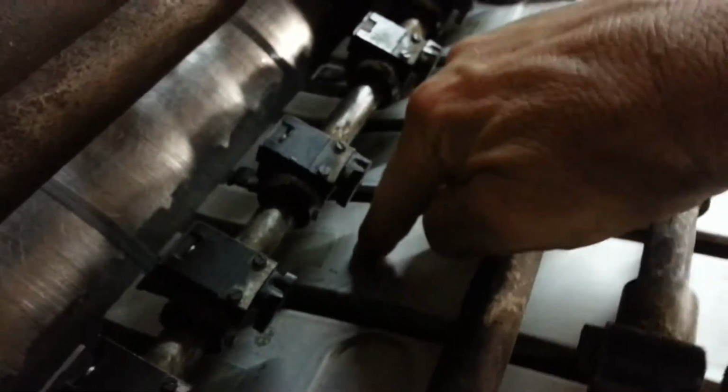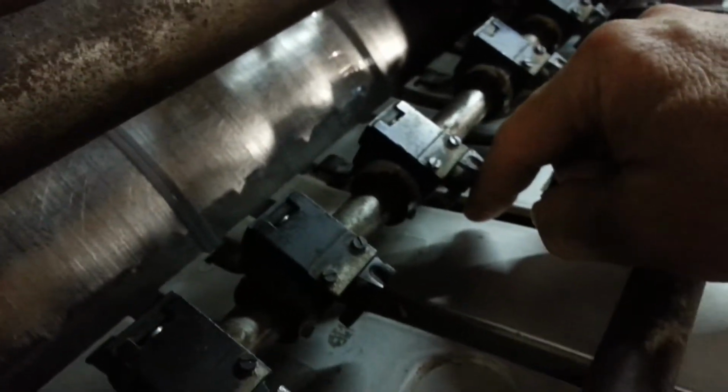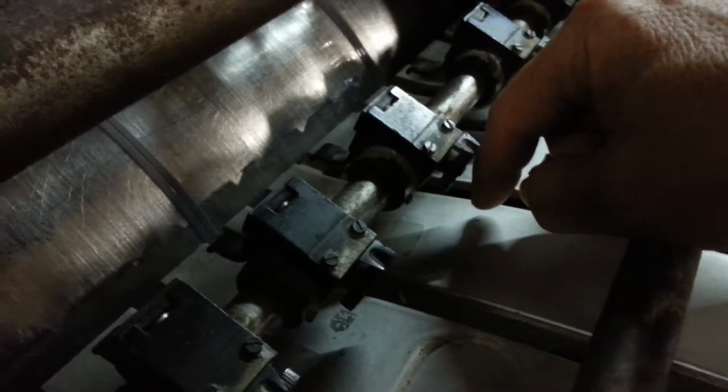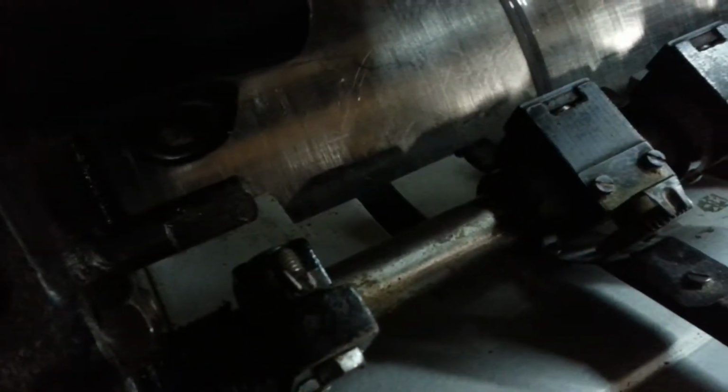But anyway, what happens is this whole plate down at the bottom next to the gripper is flexible. We actually have to run wavy sheets sometimes. We're running after it's printed, so all the moisture and the heat get into it and it waves sometimes. What I do sometimes, right in the front where those swing arm grippers are going to come into that plate, is put a piece of film or plastic and curve it up so it jumps up over it.